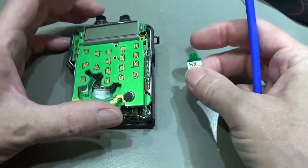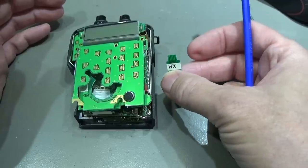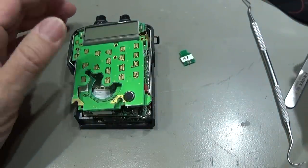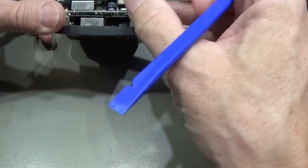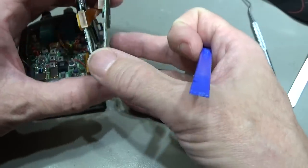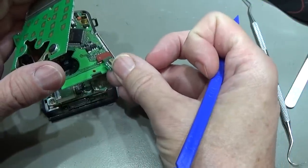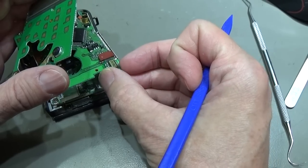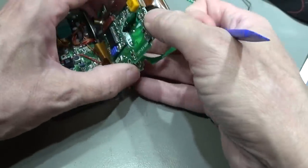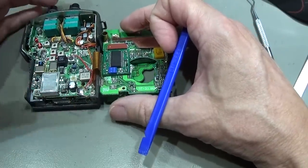And I have here the CMU or CTN, it depends, 160 module, which is finally the CTCSS unit, and that sits right, let me flip it over again, and that sits, you can better see it here, so that sits here in this slot, and it is in the way when you try to get your PCBs out. And you already see how delicate it is to take it apart, but we do not have another chance.